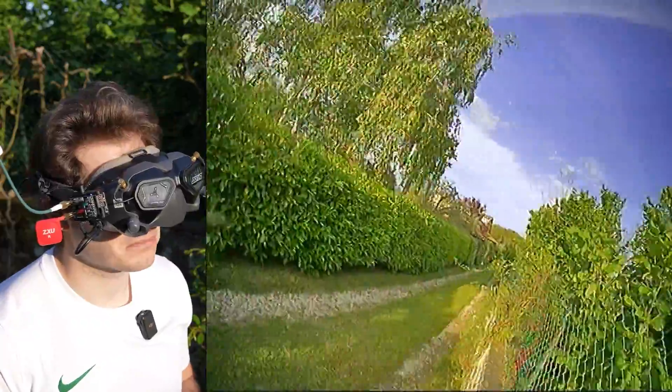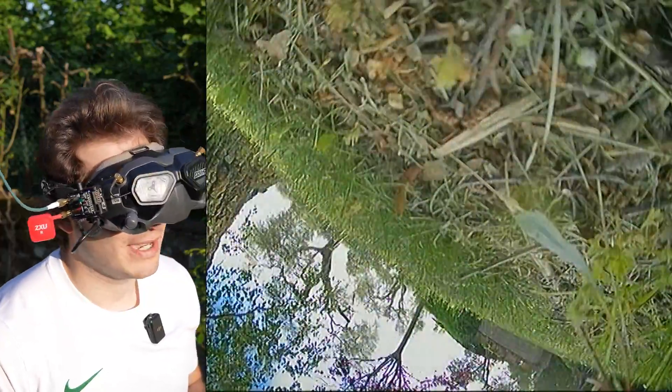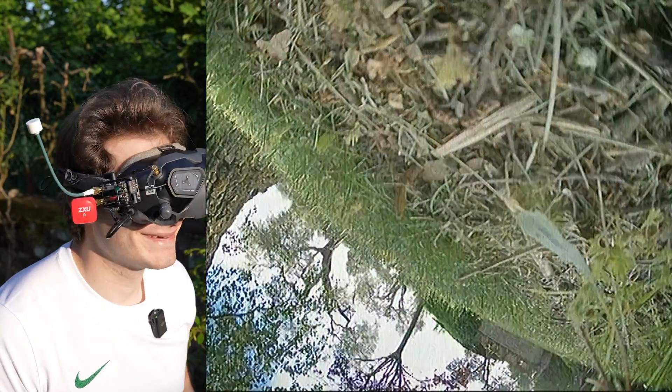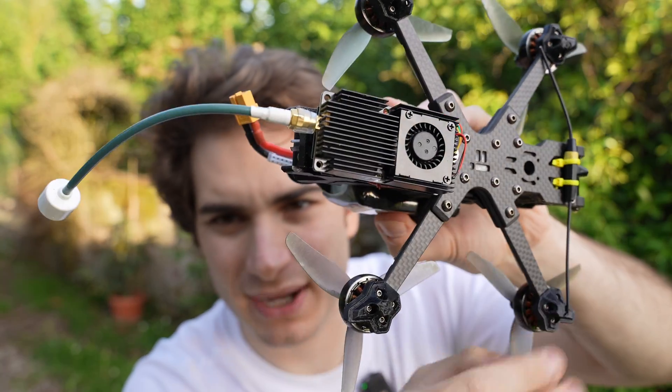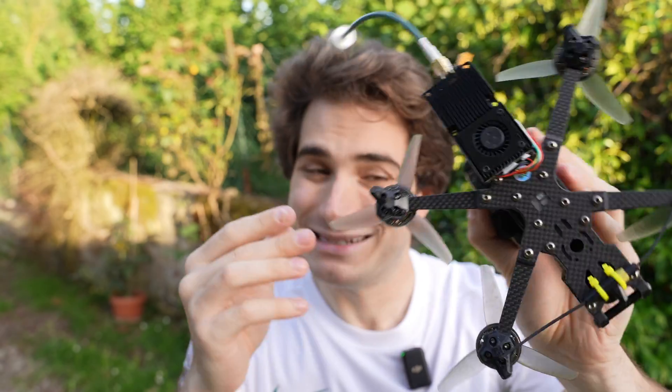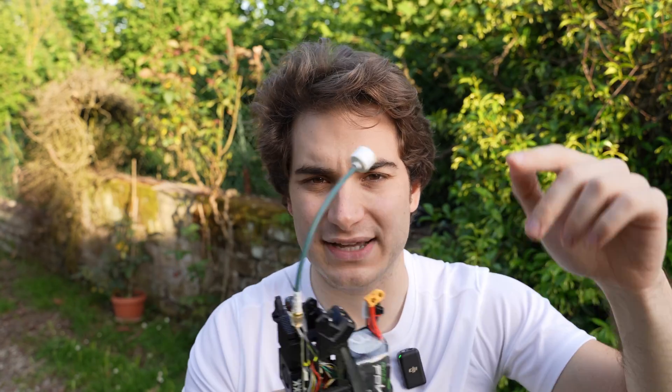Let's bring it back home. I had to crash on the easiest part. The drone is a little bit dirty from the struggle, but in very good condition. Luckily it crashed on the back, so the VTX is in pretty good shape. I have such mixed feelings with analog — you can see very bad, but 10 watts is powerful, so I was able to fly everywhere without too many issues. But as soon as you have leaves or a wall, it starts scattering the signal and you see a lot of artifacts. This VTX, as intended, is good for line of sight and long range, where you don't have too many surfaces to scatter the signal on.